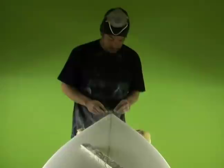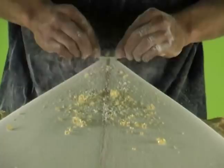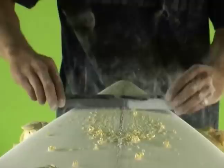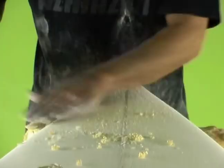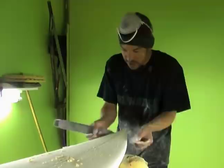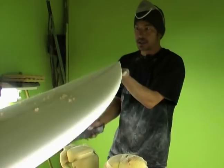And that way is to take your spokeshave. Kind of the same thing we did before, but now it's just a little bit lighter because we're getting really thin here. Notice I'm keeping it kind of square — just going to turn those just a teeny bit and blend it into the rail line that I already have.